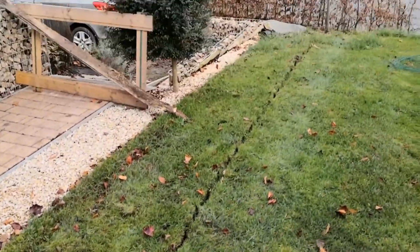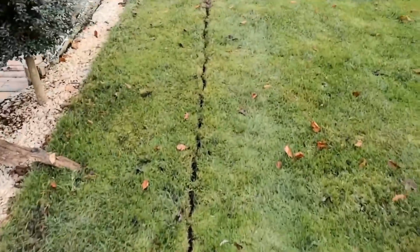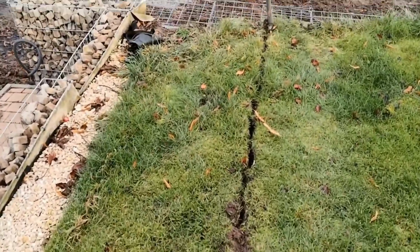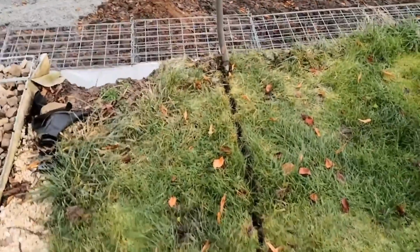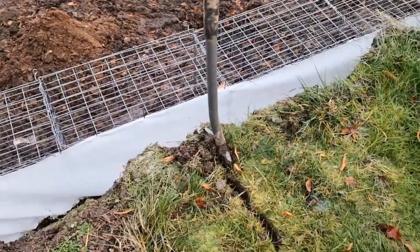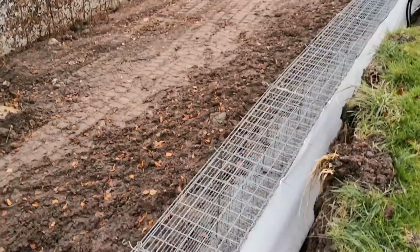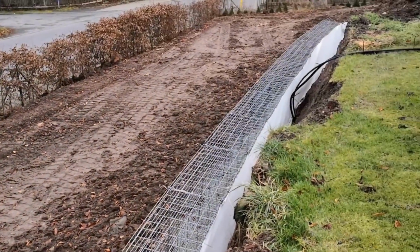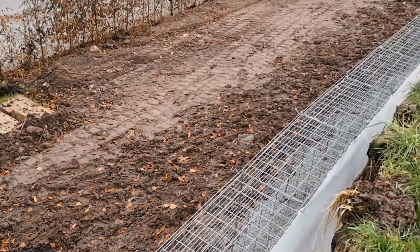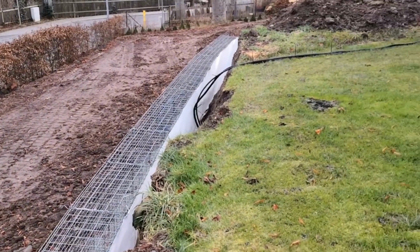I will carefully dig a trench here and place the grounding electrode somewhere in this area, completely bury it in the ground and connect it to the grounding cable. From there, a stainless steel band or a steel wire with a 10 mm cross section, approximately, will be installed and laid behind my gabions. Next year, the cable is to be laid out over this large area down there, and then covered with soil. I believe that then my potential equalization for the entire house will be sufficient again.